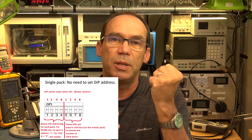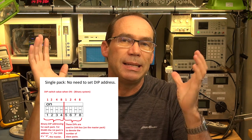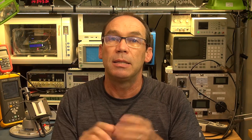The complication is that the two protocols are different — one is duplex or bidirectional, one is simplex or one-direction communication. The addressing on the DIP switches is currently designed to change depending on whether you're communicating RS485 to an inverter or CAN bus. In my case with the GROWATT being CAN bus, if you want to talk to the inverter the DIP switches need to be set one way, and if you want to use the software to talk to the batteries you have to switch them another way.